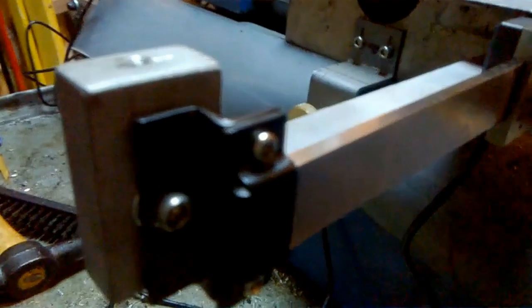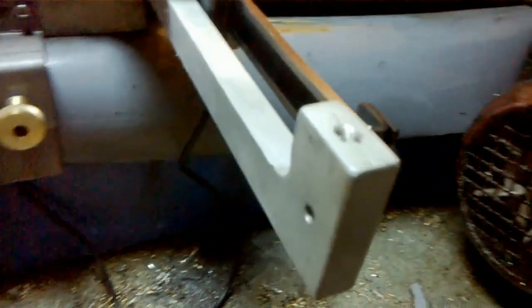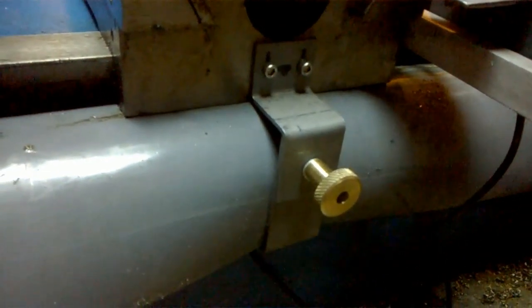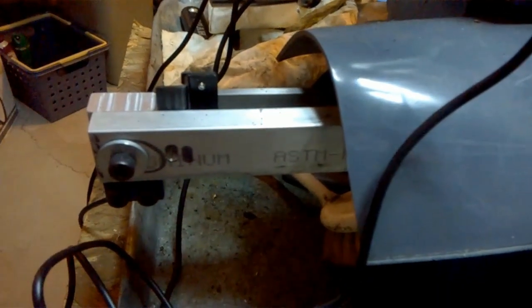This shows the end of the X axis mounting bar where I've had to put a washer underneath the bracket for spacing, to have enough clearance between the reader head itself and the mounting bar. It's also just temporarily held on with a screw until I made some more thumbscrews. The rubber sheet continues to the end of the lathe bed and the bar itself extends beyond there because the scale is longer than the lathe bed. There's another mounting screw that still needs a thumbscrew made for it.